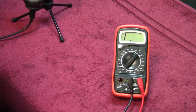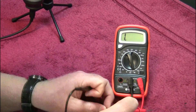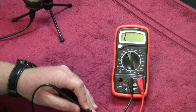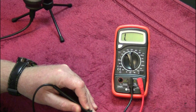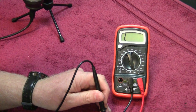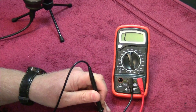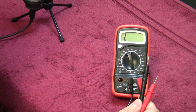Let's also try out the diode section. I've got a little transistor here — a transistor is technically just two diodes. Going to the diode test: we've got 0.823, then 0.831 on the other junction. It's fine for testing whether the device is good or not, but I wouldn't rely too much on the exact readings. Overall it's a little bit disappointing on the resistance and diode side of things, but for what I'm wanting — the voltage — not bad at all.